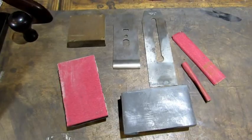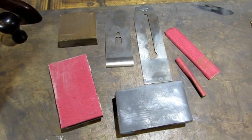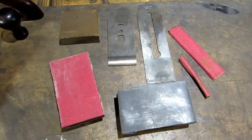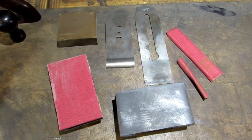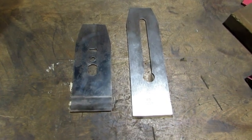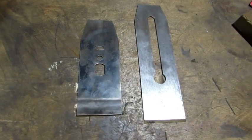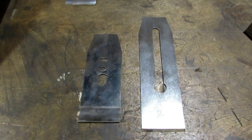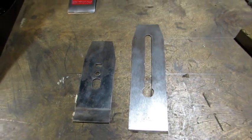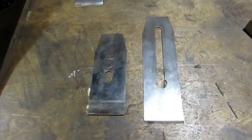While the paint dries, I'm going to clean up the cap iron and the iron. In my other videos on the cap iron and the iron I showed in great detail how to clean up and restore these things — this is just going to be a cleanup. I want to get the dirt and grime off but not change them too much. It wasn't hard at all to get the minor rust and a little bit of dirt off. If I was going to do a restoration, I would have re-blued the cap iron, and lapped both the cap iron and the iron on the flat sides. Could have made them look brand new, but that's not the idea with this plane — it's in excellent condition and I want it to remain pretty much the same.